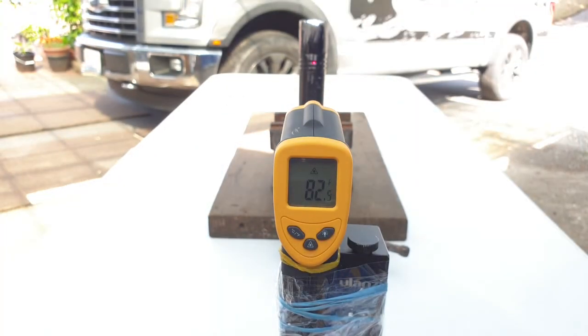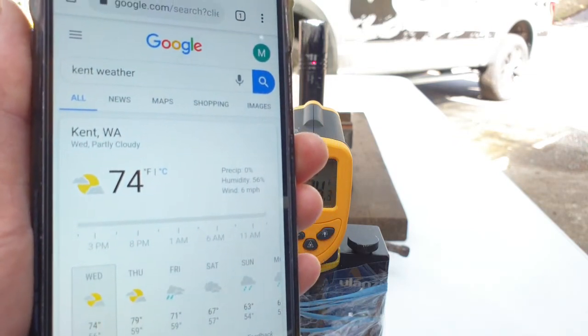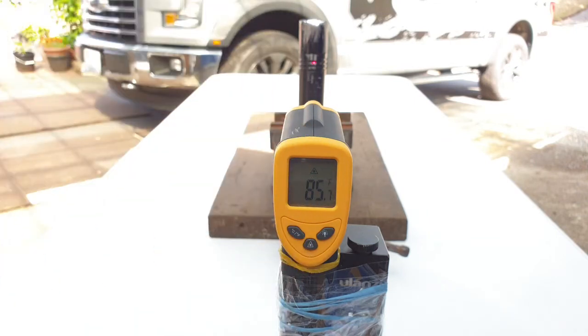So this time we're starting off at 82 degrees Fahrenheit, ambient temperature is 74. This cell should get the heat up real fast because with the Manker cell — protected — we started off roughly at 2650 lumen, and with this cell we're starting off at 4000 lumen, so it's a lot brighter and a lot hotter, and you can see the temperature climbed rather fast.